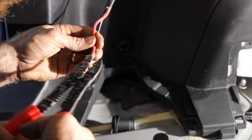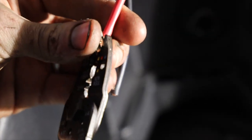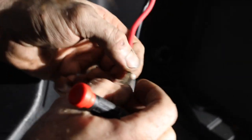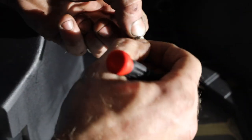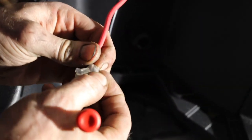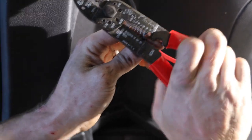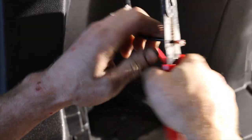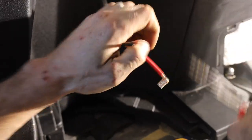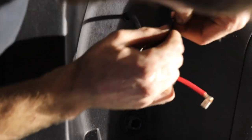Stripped it back a little bit, put that little connector on, and now we're crimping it down. Now we're putting the rubber sleeve over it - you just have to massage it on. We're using a pocket mini flathead screwdriver to help it on. Now we're on the negative cable doing the exact same thing - stripping it and crimping the cable. Out of an abundance of caution - you don't need to do it - but we are going to solder the cables to the crimp just to make it a little bit safer. In the event it were to come off, you don't have a live cable flopping around.